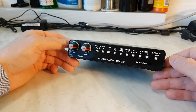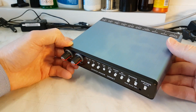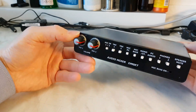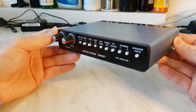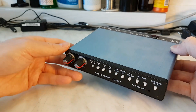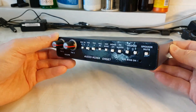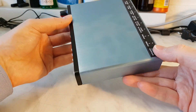Or you want to switch your radio recording to the PC computer. So it's very easy now with the audio mixer to do it from one place on the table. I made this equipment from an aluminum metallic box, and this mixer is made only with switches inside. There is a bunch of cables inside and there is no electronics, no active circuits or anything else - it's just a fully analog switching system inside.